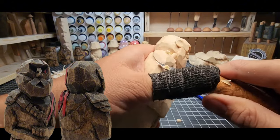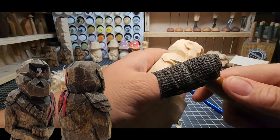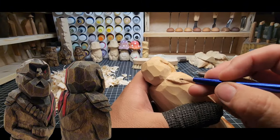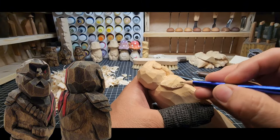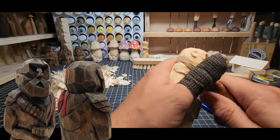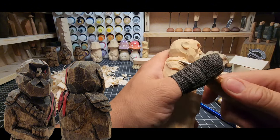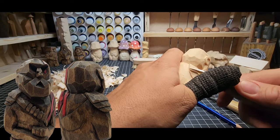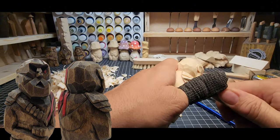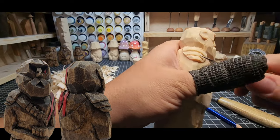We'll probably round out the pauldron a little bit more because it's kind of sharp at the angle there as well. Right here we're going to round this all off — that looks a little bit better. Our pauldron shouldn't be too blocky. Then take that end off like that, draw a couple lines here for the lines of the pauldron, stop cut those, and then cut up to them from the base — the top one first, and then come up to it, nice and easy. Do the one below it as well, as we clean that up — just one stop cut along all of it, and that adds the definition and detail that'll be fantastic.